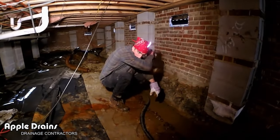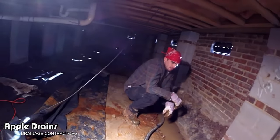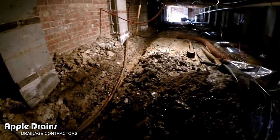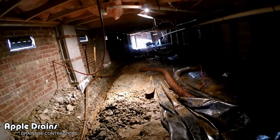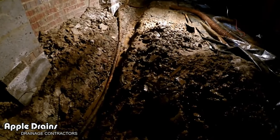This was their discharge line from the sump pump, and you can see all the water just laying in the trench. We're going to try to get this water to flow back toward the original sump pit and also over to this corner. We've started trenching out the old system. We need that water to move toward this sump pit where we'll put a new pump, and down to the other end where we'll put another pump. It needs to get down about 10 to 12 inches.